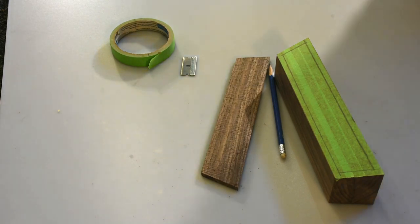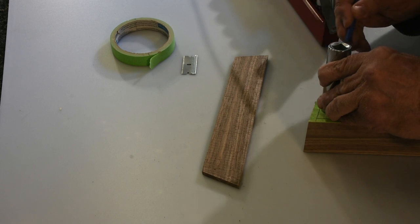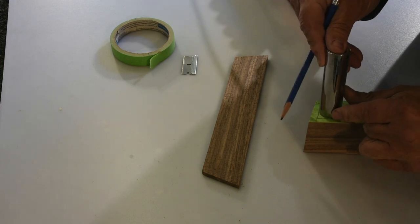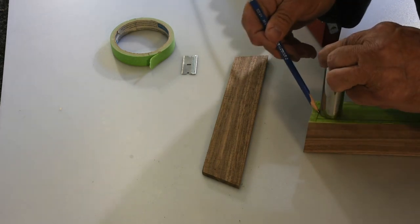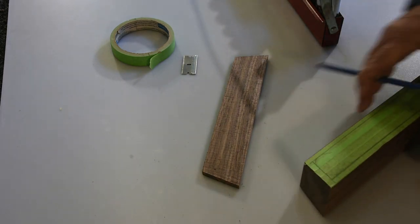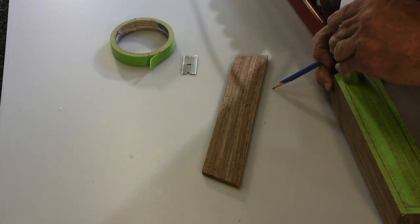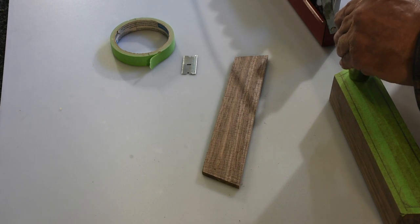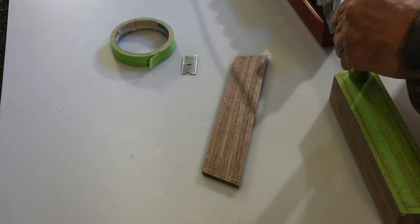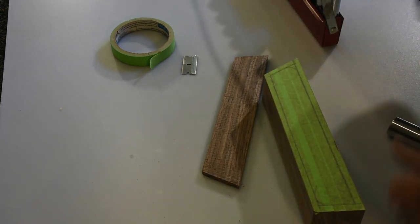I'm marking out my radius on the corners. What I like to use is a socket set — everybody has one around and they're great for a small radius. I'll show you how I pick the right size, because even with a quarter-inch or three-eighths blade, every blade runs a little differently on the corner. I run a sample first. I'm using a three-quarter-inch deep socket here — easier to hold. You can see the corners are marked out.